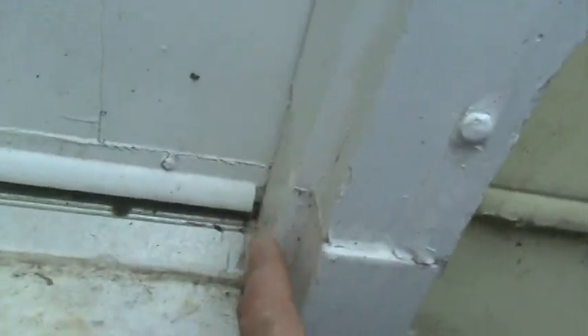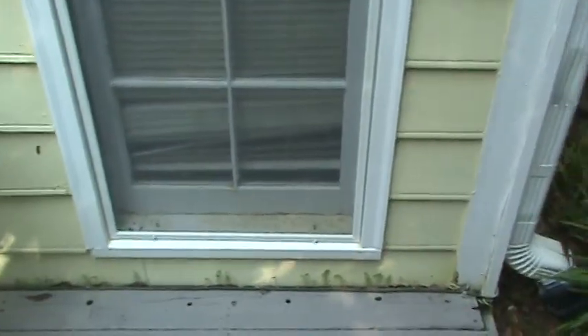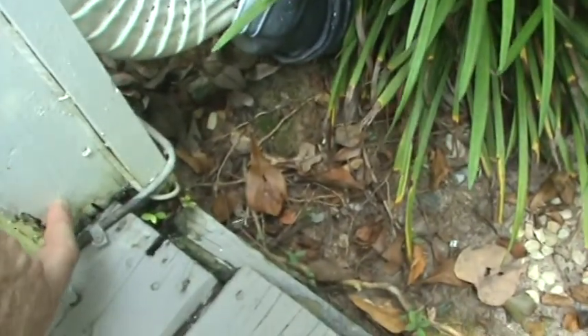Down here on the door, this is exactly what you don't do — we'll show you the repair. They didn't even have the brick mold, so they just came in here with a piece of deck two-by-two, cut it, and slapped it in there, slapped a piece of hinge wood above. It's the wrong cut — a horizontal cut on this right side frame. They took a molded one-piece frame and just slapped it in there. We started just going ahead and fixing it without charging him — he's already paid once or twice. So we'll do it right this time. Down here on the right rear corner the corner board is completely rotted — you can put your finger right through it. We'll replace that corner board, piece in about a two-foot section, and then the bottom three rows of siding at this right rear deck also need to be replaced.